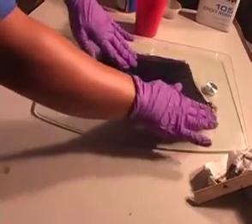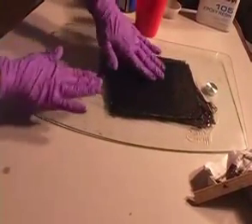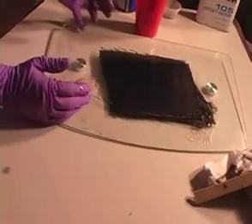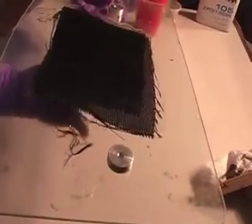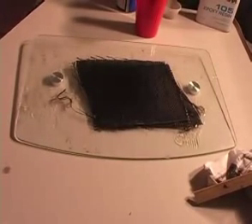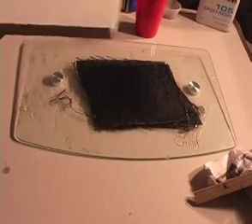If the part you are building needs to be rigid, apply at least three layers of mat. For trim pieces, two layers is usually enough. Another benefit of working on glass is the ability to inspect the piece before the resin has a chance to cure. What you are looking for is any anomalies in the pattern or air pockets. Air pockets are easy to correct by gently working them to the outside edge. Anomalies can be pulled out usually if the resin has not cured to a state that has started to gel.